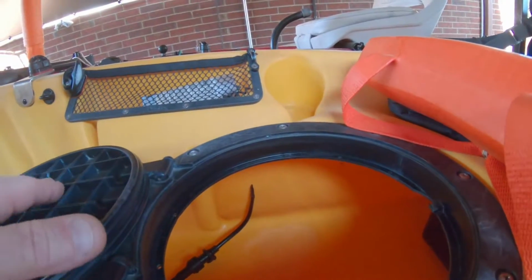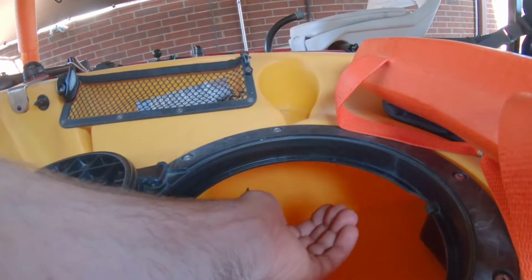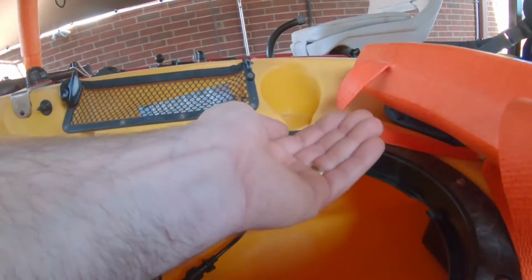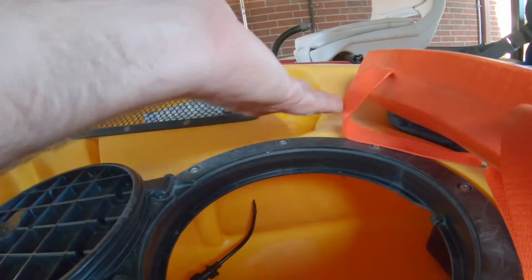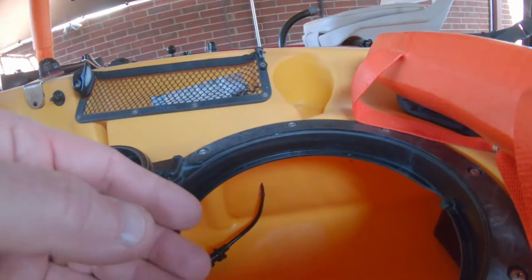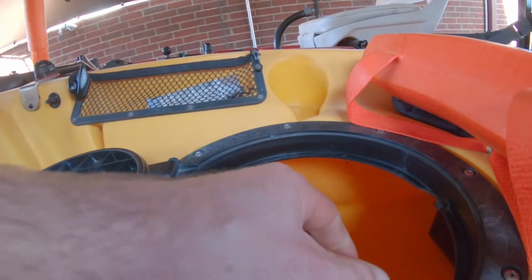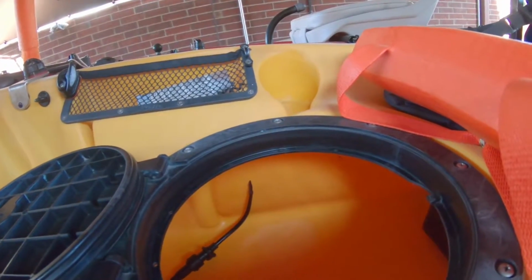And thinking about it over the day, it might be because of the lift, the head that it had to come up, because I had it coming out of the hatch. It's possible that's why it was more, but I think it would have been more with the check valve and the smaller discharge diameter coming out of that drain port in the back.